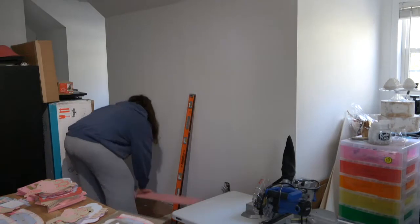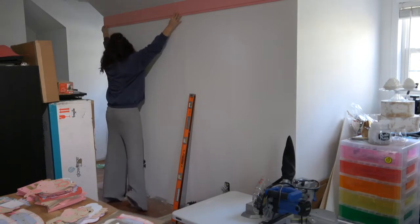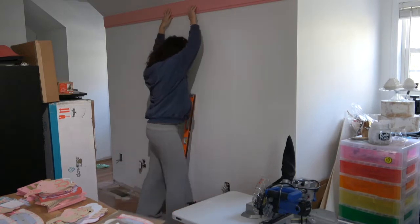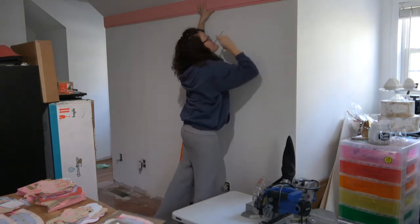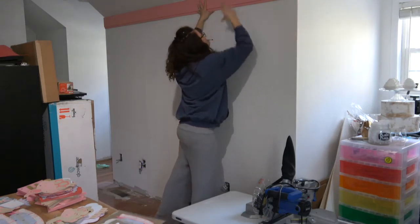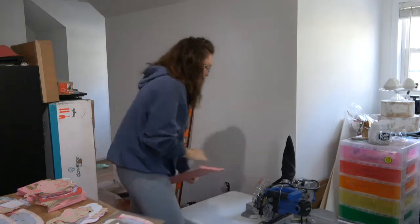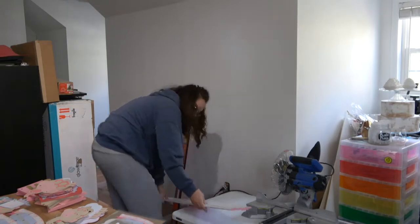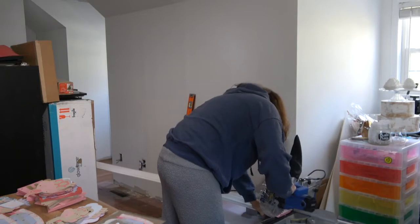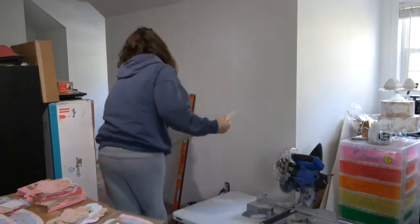Finished painting — now up to the office. What I'm doing here is lining up the board to the very left, flush with the corner, and going over to the very right, taking the back of my pen to score a line on the board because they are just a little bit too long for my wall. Instead of taking multiple trips back and forth to the office, I decided to just bring the saw upstairs. All I'm doing with the saw is taking off the very edge of the overhang — it ended up being about a quarter of an inch for me.